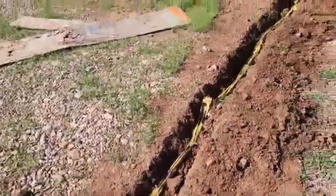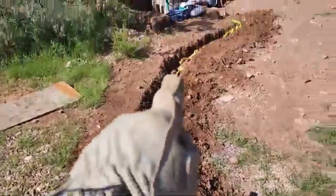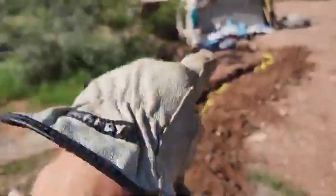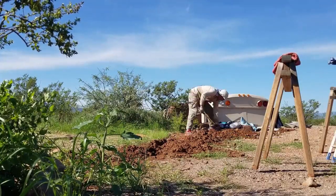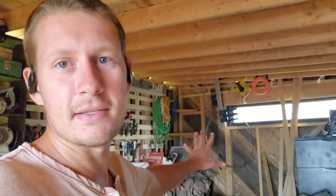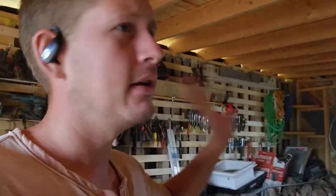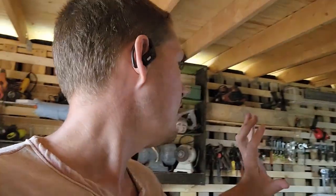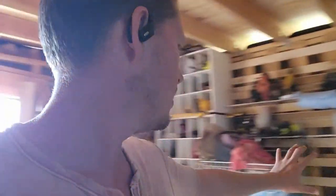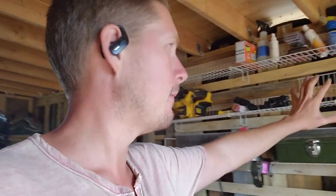One thing I like to do is put down some caution tape — basically you have your wire, a couple inches of dirt, caution tape, then a couple more inches of dirt. We've got our breaker box in the back; eventually that'll house all of our main everything and centralize it. I'm going to be doing our workbench over here with a station for bench tools, a main power tool station, charging batteries, and an outlet on the outside.